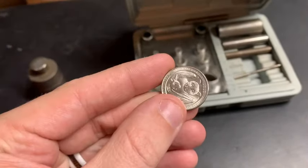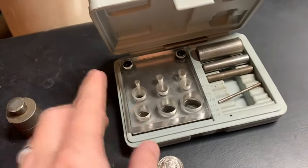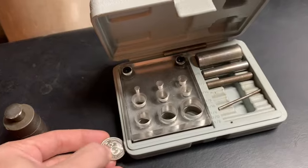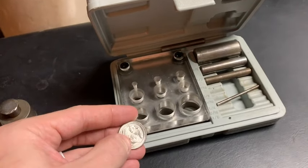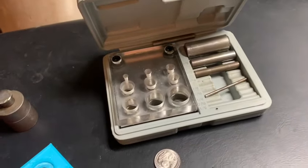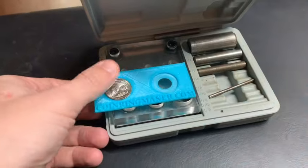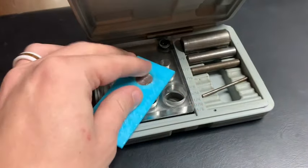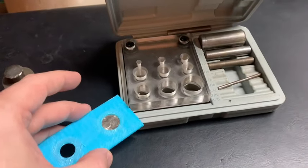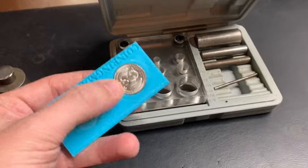When I first started coin ring making I got this punch and die kit from Harbor Freight. It's a good tool, but it's very difficult to get the coin perfectly centered under here and get that hole perfect without added tools. So I made this guide which allows you to put your coin in there, then you flip it over — this perfectly fits a half-inch punch — slide it in here, and guide the punch on top until it slides into that hole, and that'll get you a perfectly centered punch.